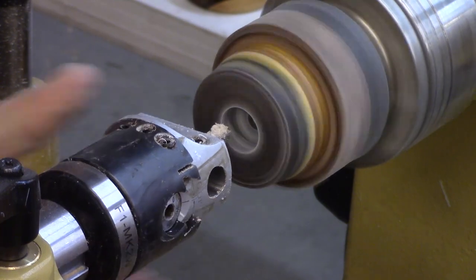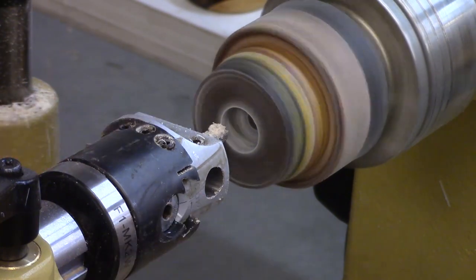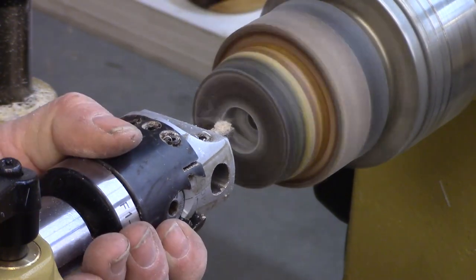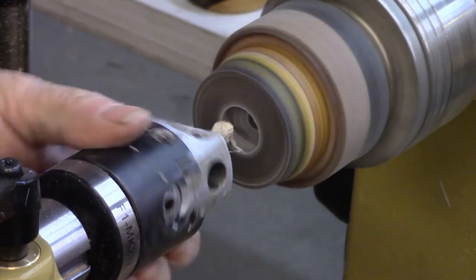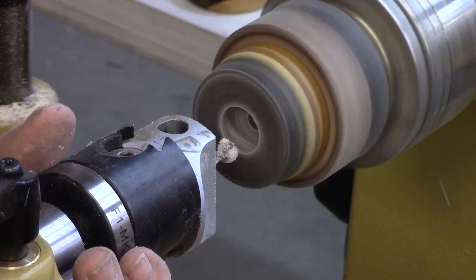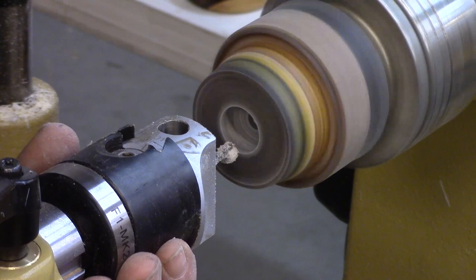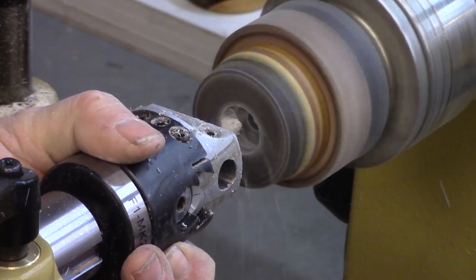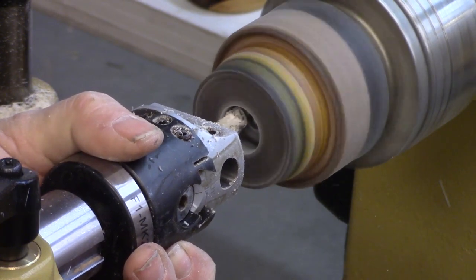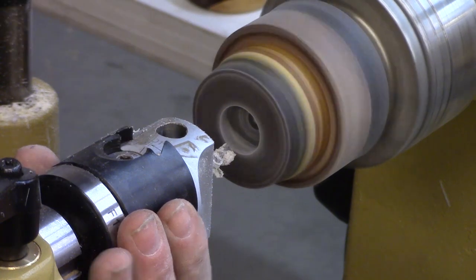You're the same distance off-center whether you're at 9 o'clock, 6 o'clock, 3 o'clock, or 12 o'clock. Because you're cutting off-center, it should cut the same. That's a possibility. When I first tried it, I was using it with the cutter position down, and I couldn't get control of it right. It just didn't work well for me, so I started doing it this way. I'm doing 10 1/100ths at a time right now, and I found that it really worked good for me.